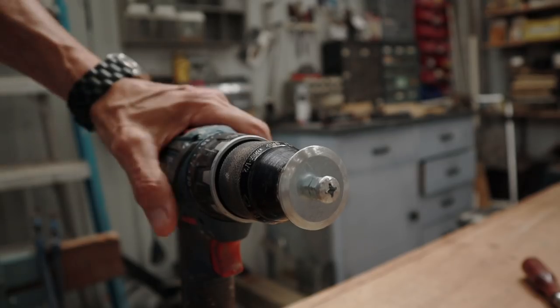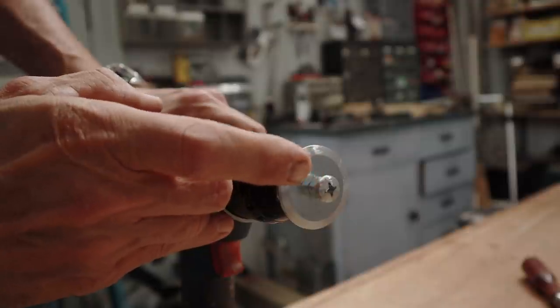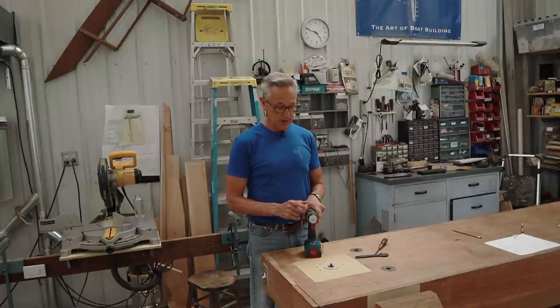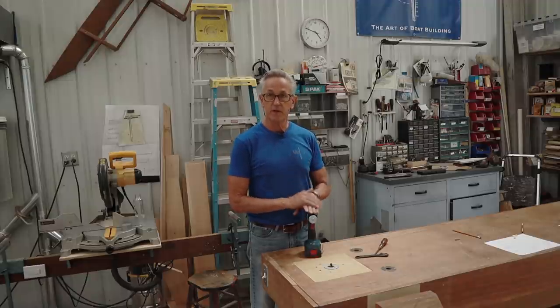See how that put a really nice taper on there. Now I'll clean that up with a little sandpaper and some polish to make it nice and smooth. And then I'll flip it over and I'll do the other washer on the back side so that I've got that V taper to the whole thing. Once that's finished, then we can turn our attention to the handle.